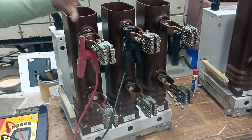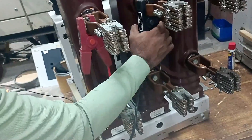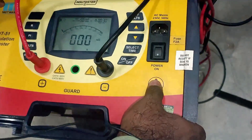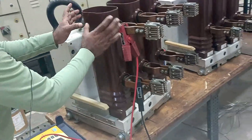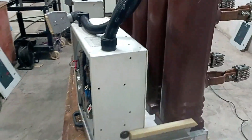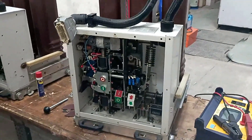We measured IR value between poles in the ON condition. Now turn off the breaker, and measure IR value between the incoming contact and the outgoing contact in the OFF condition. Connect the insulation tester clamps to these two contact points and press the test button. The IR value between the open contacts is displayed. Repeat for all remaining contact pairs. So today through this video I explained how the VCB breaker works and what all things to check during maintenance. I hope you liked this video — please like, share, comment, and subscribe to the channel.